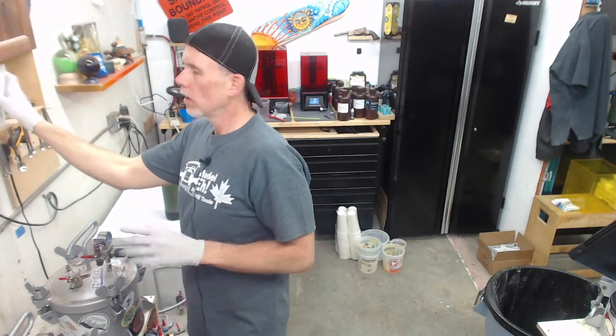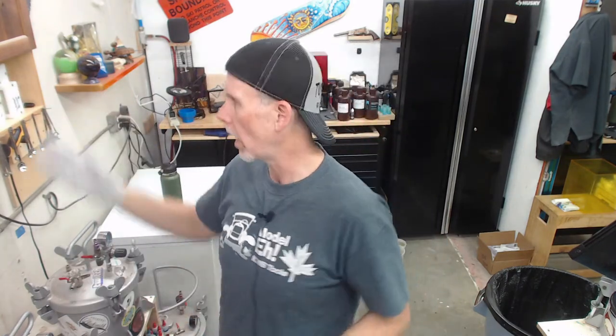And then you also have to watch out. If it's 90 degrees in your shop, I would probably not recommend casting those big 2-inch blocks of it. But I think I've even done maybe a 4-inch PVC pipe. That might have worked, but it does exotherm hotter. That's why I like Alumilite Clear Slow. You can do so many different things with it, and on top of all that, you can cast a bucket of it and it's not going to overheat.